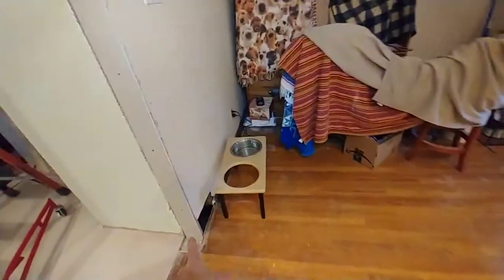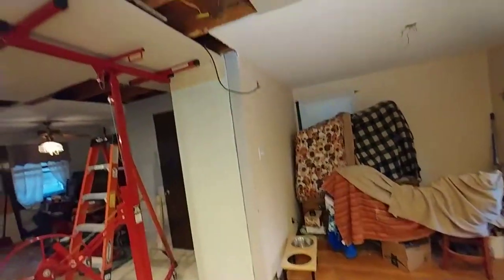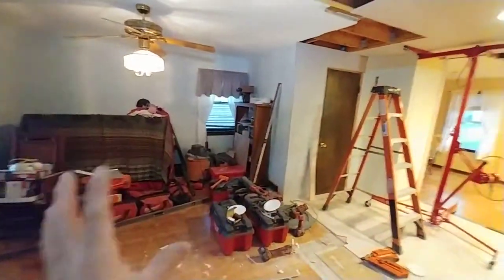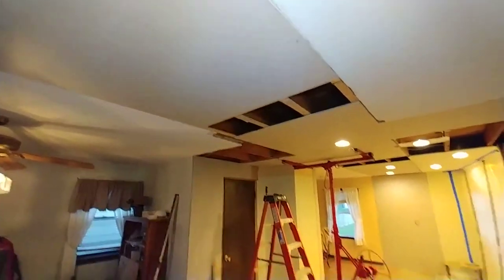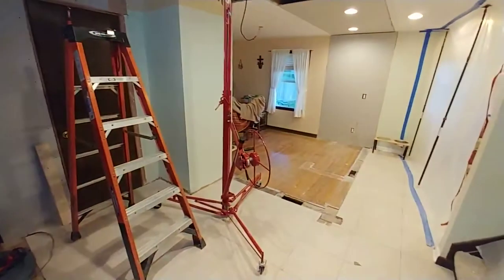Tomorrow we'll get the last couple of pieces up. There's a little bit of fiddling around the corner here and there, and we've got to cover up this little spot and go upstairs to play around over top of the registers we added. We'll be applying drywall this week — we probably won't get anything taped or any mud out as we're off Friday and it's a long weekend. Next week we'll be back to clean up, put down some drop cloth, and tape. We'll mix up hot mud for our larger bad joints, then use ultralight air-dry on top of that, do some quick sanding, and then break out the paint — so a couple more episodes and we'll be looking sweet here. Thanks for watching.